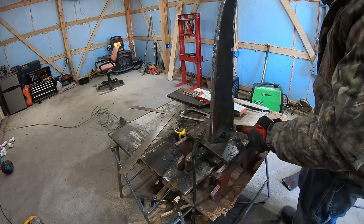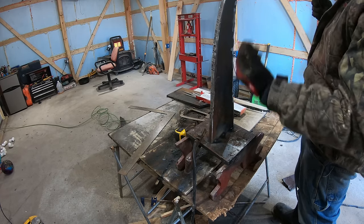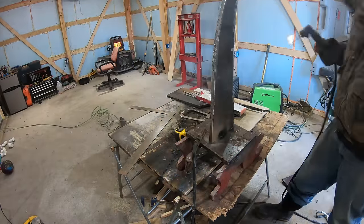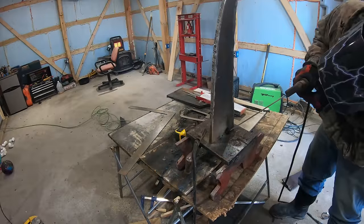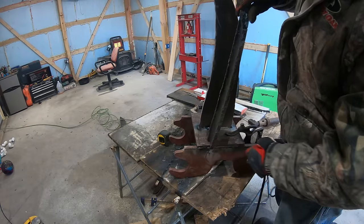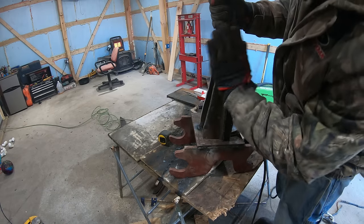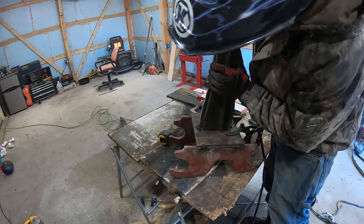So I'm still only going to do little patches at a time. I don't want to weld the whole one side. It'll probably warp this a little bit in. You know, I cut this out of an I-beam. So that's as close as I could get with the plasma cutter. So there's this ridge on here. But I think I'm just gonna leave that on there, and it gives it more support from wanting to shear over. So what I'm gonna do with this is I'm gonna pull it up